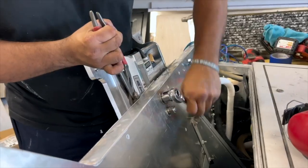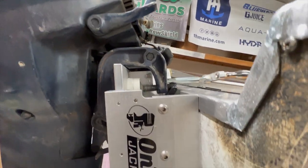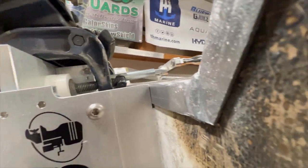At stock transom height when you drop your motor on and it's on plane, if you have something extending the depth of your motor when your boat is trying to get on pad, it's actually deeper in the water. For that reason, for every so many inches you go past the transom, it has to go up one inch - estimated around three inches. A lot of jack plates already have about a two to three inch rise built in because they're three to six inches thick on average.